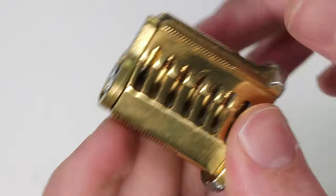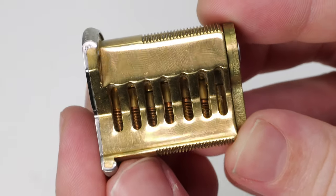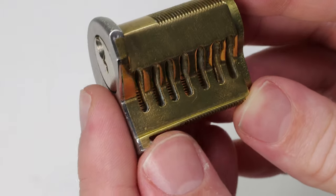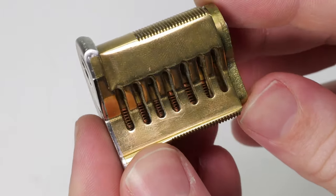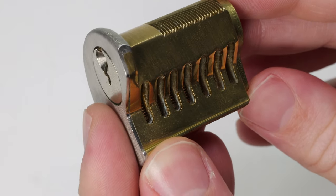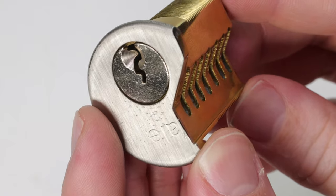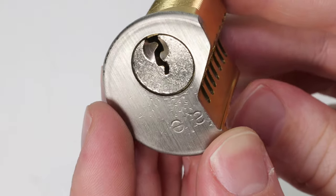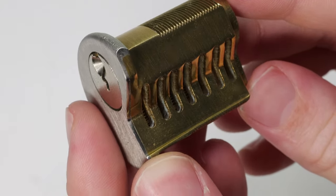The other thing is when you put the lock in the pins-down position, which you see very frequently in European locks, it's going to make it so that all of the pins drop down and it's going to make it impossible for the key to work. When you have a lock oriented in this direction it is very important to make sure you have adequately working springs, because when they start to wear out your lock is going to be more likely to not work very smoothly.